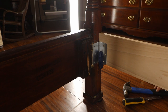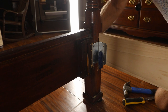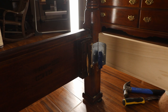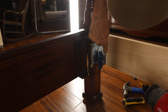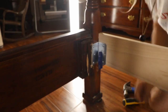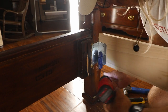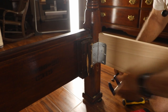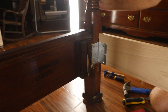Same thing on this end — got it right flush here, lumber's all nice and tight up against the end of the rail. I can't get any tighter than that. Now as I'm putting these screws in I'm favoring this side of the holes so the screws are sort of pulling everything together. It's also a very tight fit — I'm using an impact gun. That way we have a good tight fit. Taking the clamp off now — yeah, that's pretty tight, you can't do anything with this.